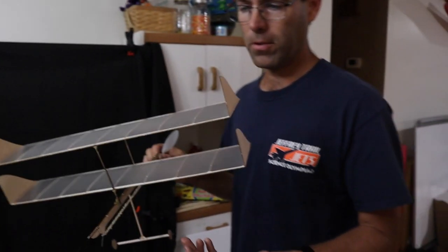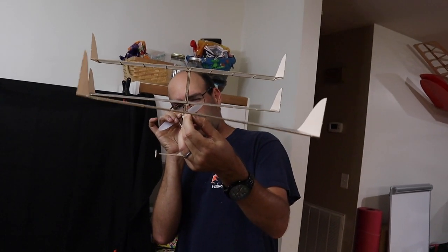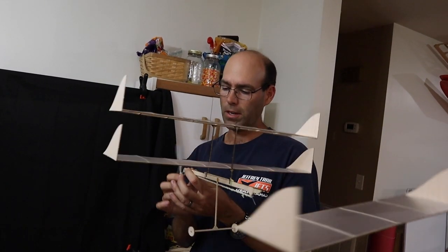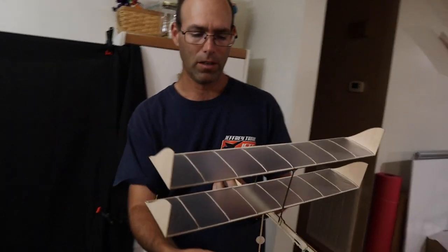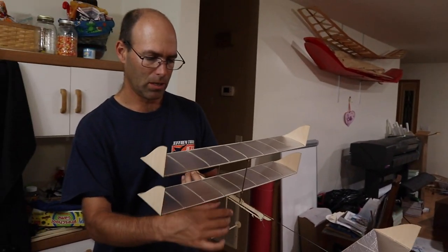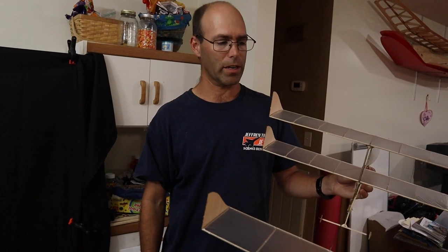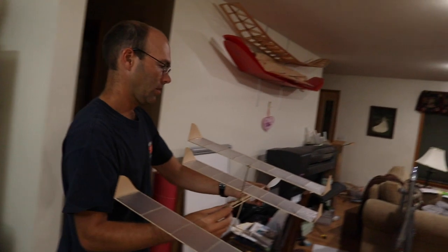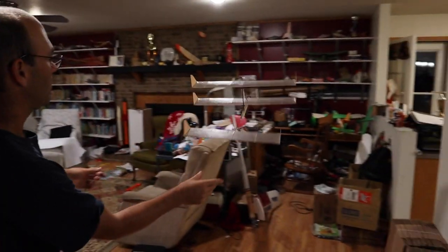All right, so we've got the airplane wound back up. Now this time, since the airplane was turning really tightly, we're going to set that to about zero stab tilt. We may end up needing to take out a little bit of the left thrust if it's turning really tightly to the left. May not be a problem. Some places that's beneficial, but the big thing is if you turn too tightly, the airplane will fly through its own wake on the way down, and you'll see it dip a wing and lose a bunch of height from that. So since the airplane was circling really tightly, we're going to launch over this way.